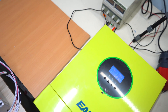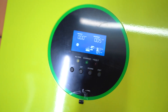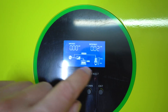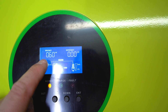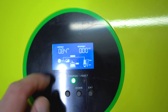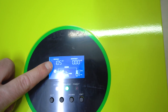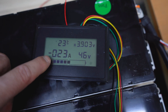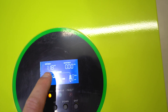Now I will hook up the AC input. The AC current is now showing — we have a bypass here and battery charging. It is set up to 25 amps and we have 24–23 amps here, which is pretty accurate. The power is 1.18 kilowatts.